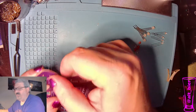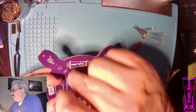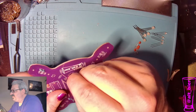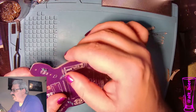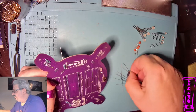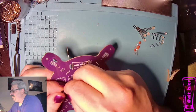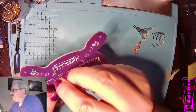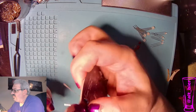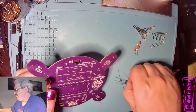So if you are getting one of these at DEFCON, I will be hanging around the Hardware Hacking Village helping people that have issues soldering them, especially that tiny transistor. I'll have a quick and easy way to put that on for people using solder paste and a hot air gun that I'll be bringing. But yeah, it's not that difficult. I know people that haven't done surface mount components but do solder might get nervous about it. It's not that bad.